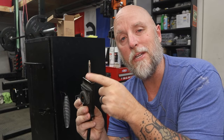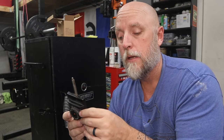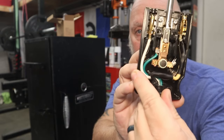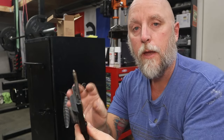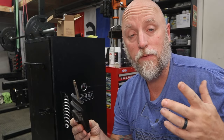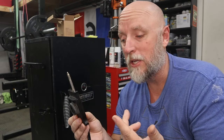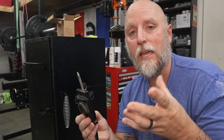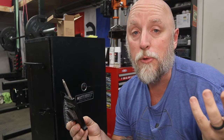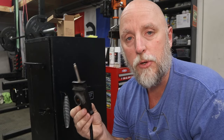This just doesn't allow it to get hot enough. So I ran a little test. I bypassed the temperature probe, and then I did another test. So that got up hot enough, way hot enough. But the problem is, I can't control it. It's just gonna continue to heat up. I can't keep it around that 420 degree range or any temperature range based on whatever powder I wanna use. I have to be able to control that temperature.